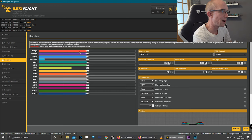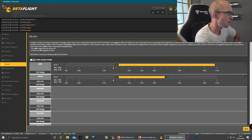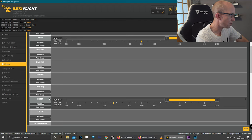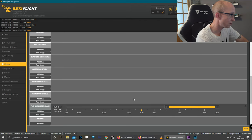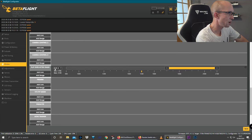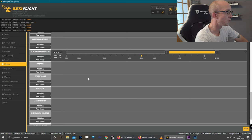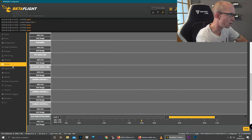My receiver isn't powered over USB, so I'll have to plug a battery in to check it. They have arming on AUX3 — I use AUX1. Angle mode: I use AUX2 for my mode select switch. Beeper I have on AUX3. I have flip over crash on AUX4. Not bad — they at least had some modes set up. But depending on what transmitter you're using and what switches you want the modes on, that's quite an important one to go in and change.